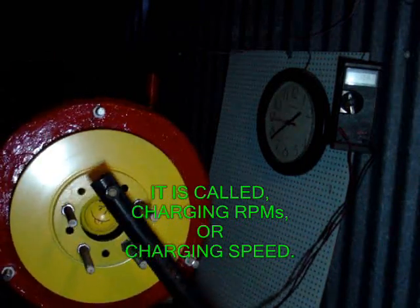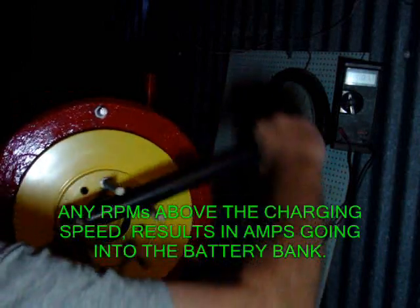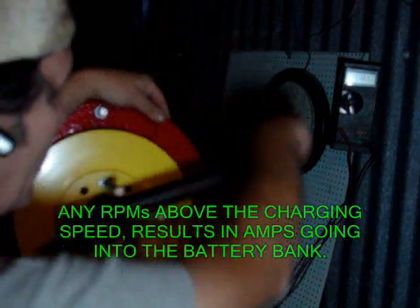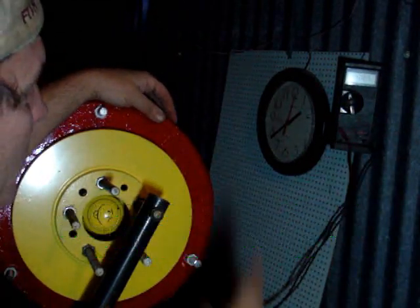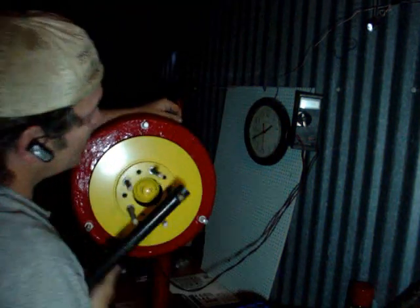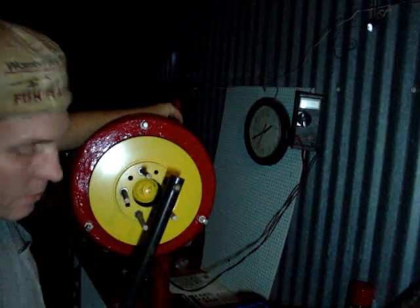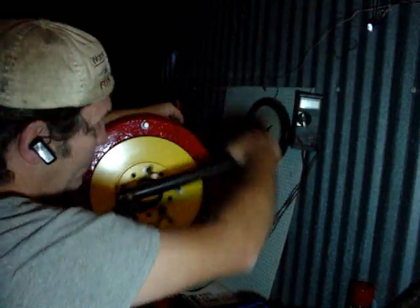That's AC across basically one set of coils. When the wind is blowing real hard and you're finally up to the RPM where it meets your battery voltage, whatever pressure is left over tries to push the voltage higher, but the battery draws the amps. The amount of amps drawn corresponds to how much pressure I'm putting on this. If I press down and got eight amps with just that much pressure and only that much leverage...